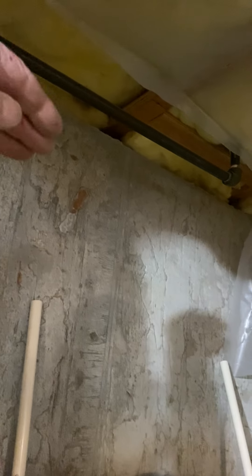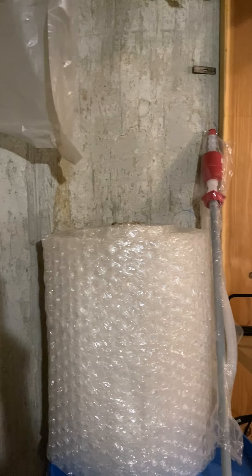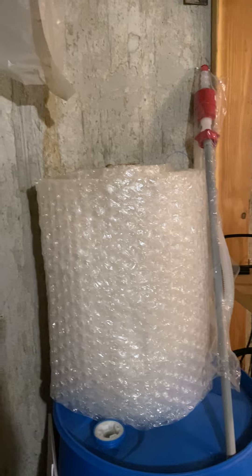We're going to vent the bathroom fan too. I figure they're going to have to drop down this whole ceiling, at least down to the gas line. So we'll just run the 4-inch vent flex and drop it down over the toilet — drop it down so the plumber, or the electrician, can put his fan on either side. Then hop up and out to a 4-inch dryer vent.